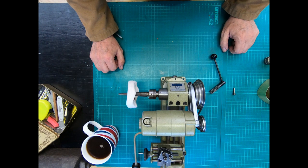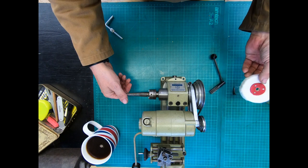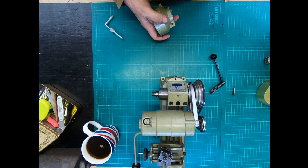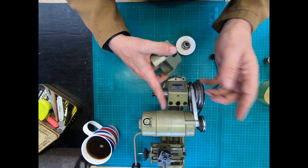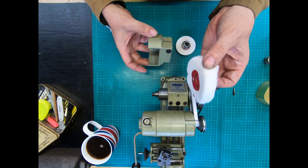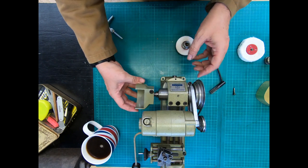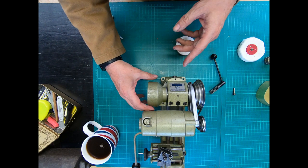The Unimat can then be used for polishing just as normal. It's a pretty simple process and quite a useful one - just more functionality for the Unimat. The other attachment is a grinding wheel, and we've got a guard for it. Again in this exact same position, you would just turn this whether you're buffing something or grinding. The guard is just a hole the size of the spindle and one screw to put it on.